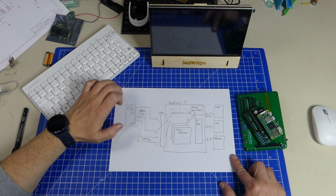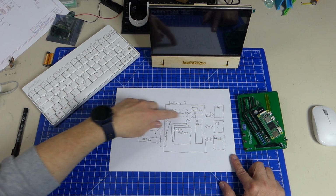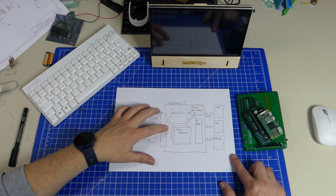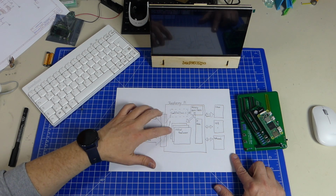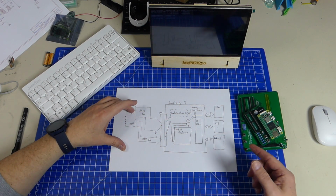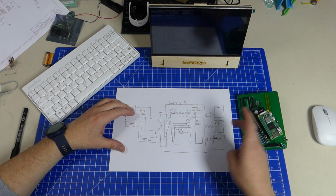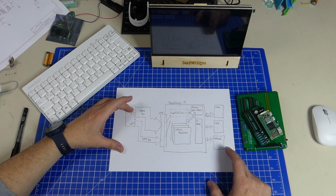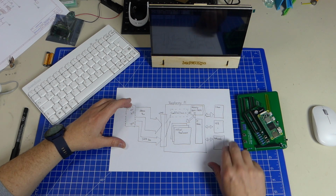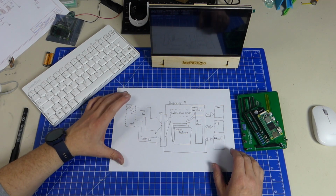Because in a 6502, most hardware is memory mapped. The memory actually maps to virtual hardware, and the virtual hardware has access to I/O stubs. And these I/O stubs perform functions to give you video, USB, and network. Right up to now, I have video working, and USB. Network is still a long ways out, I think.